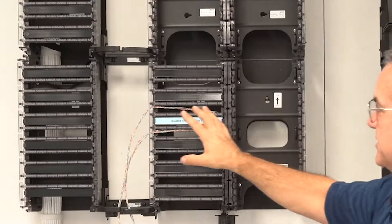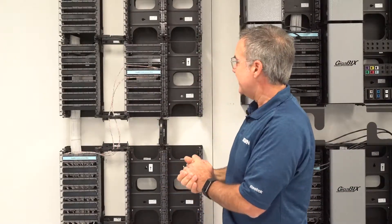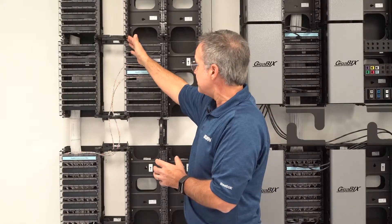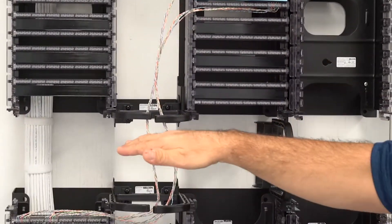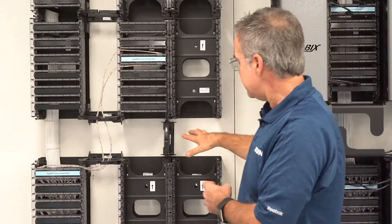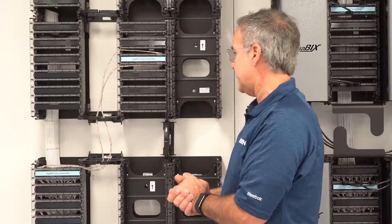These are empty mounts, and these are preloaded mounts with the connectors. They can be purchased as a kit with all the connectors, the labeling strips, and everything else needed to terminate all 72 cables, included under one part number. The management rings are used to create the vertical management channels. The same rings are also used to create the horizontal channel when you have a large installation and need to run your cross-connect wires horizontally. The management rings are installed on what we call the management ring spacer to give it more stability.